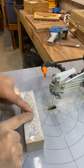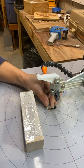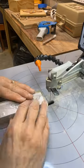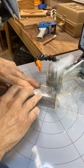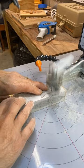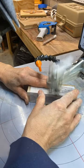My blade made it through the whole cut but it was really struggling at the end, so make sure that you have plenty of blades on hand. It wouldn't surprise me if I used three or four on this piece. I'm putting in a brand new blade before cutting out this side. Don't forget to tape the whole piece together before cutting the side profile. Interestingly, going with the grain is the most difficult and slowest part to cut, and when you go against the grain it's a lot easier. It's also more difficult to do curves because you want to push the wood, which you can't do.